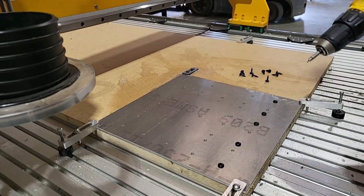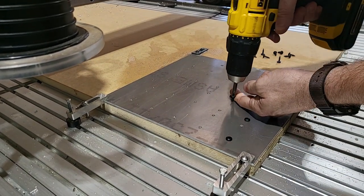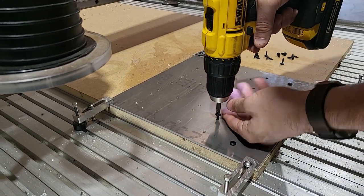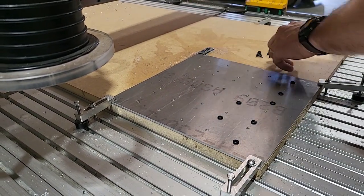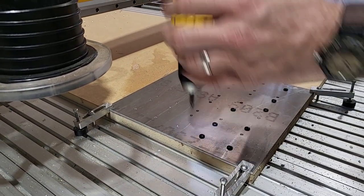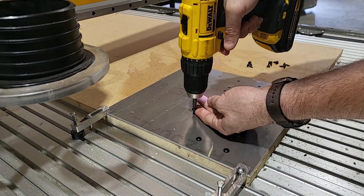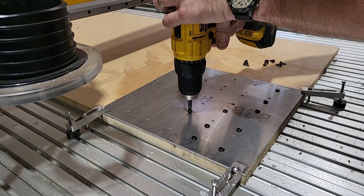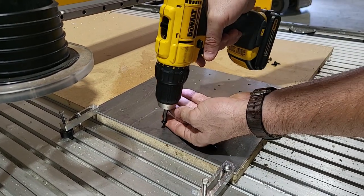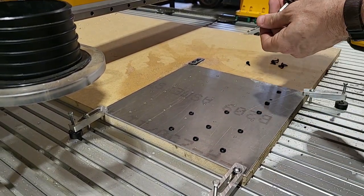The holes came out really well — they've been bored to the right size. I've got an optional stop there, spindle off, and I'm going to install some wood screws into the MDF just to hold everything down as we contour. We have a blog post on workholding — there are a lot of different ways to do it. If I was cutting hundreds of these I probably wouldn't do this, but for 40 or 50 it works fine. I'm making sure I have clearance on the heads of my screws, and when you see us again we'll be contouring.